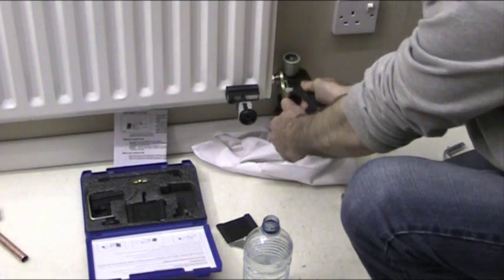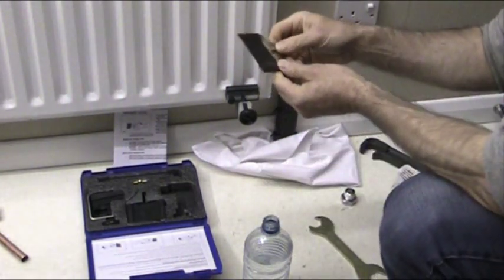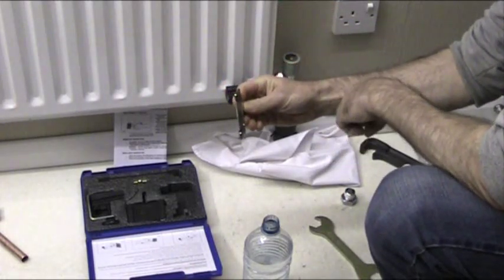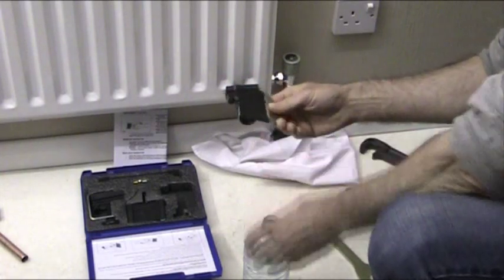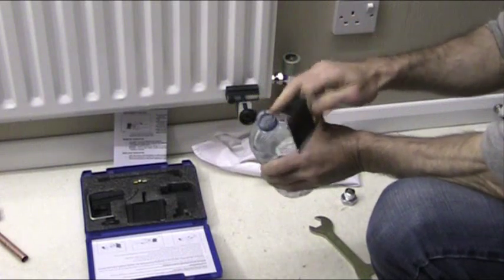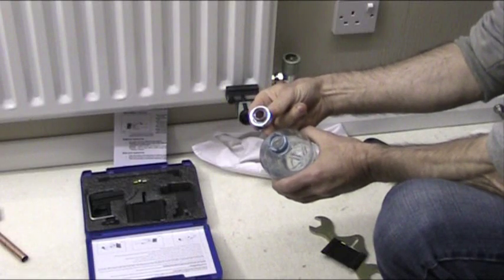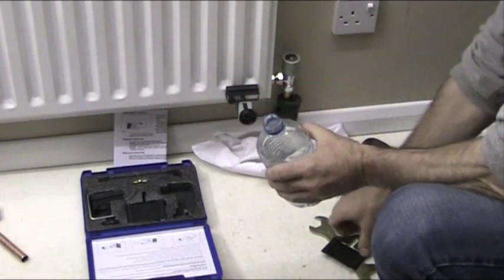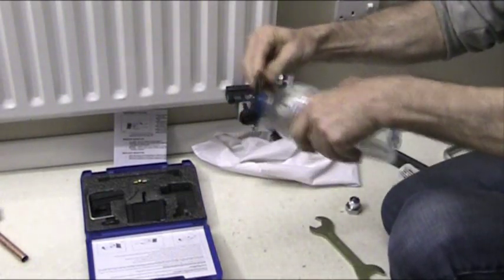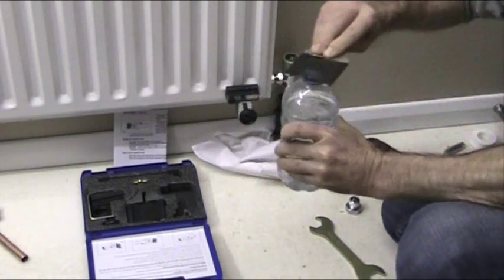Now at this point nothing's going to come out. To stop the water coming out we're going to use this thin rubber membrane seal. If you look down the end of it you can see it's very thin, so it will go inside the gap very easily. The principle is — if you look at this bottle of water here, you'll see the top of the bottle is about the same diameter as a normal tailpiece protruding out of the radiator. If you put the rubber membrane over the bottle and tilt it to the side, you can see it's holding the water in — not a single drop coming out — and that's how we're going to do it.